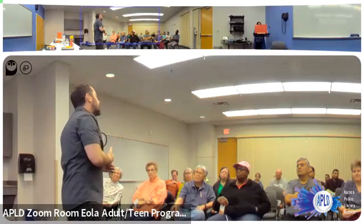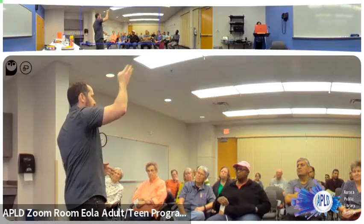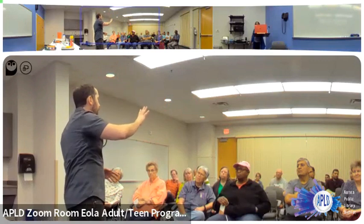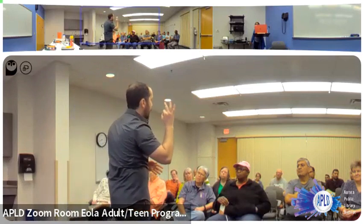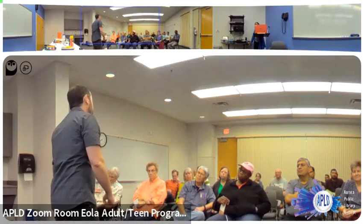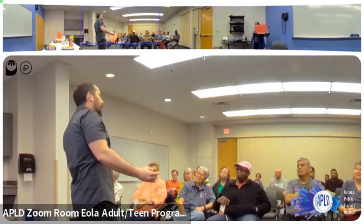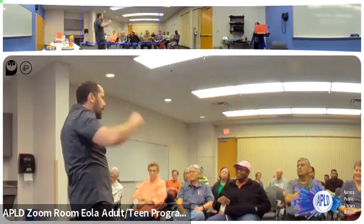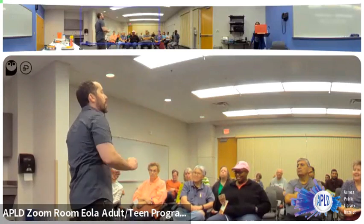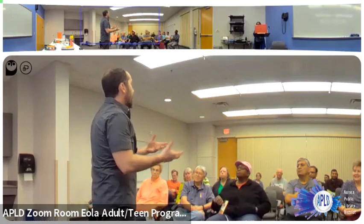The other thing you could do would just be to buy a paper accordion-style filter. Like if you're looking at a furnace filter, they come pleated. That kind. The cheapest one they make should have what they call a MERV rating on it, MERV. And it's a number. The lowest number you can find is the one you want. If you buy it at the big orange store, it won't have a MERV rating. It'll have like the HD efficiency filter number. So like they made it up. I don't know why they can't just work with the standard that everybody else in the world works. Anyways, the lower the number, the less filtery that filter is going to be. And that's what you want.